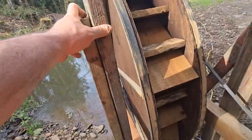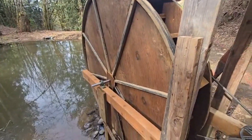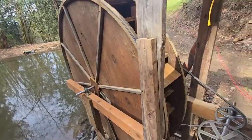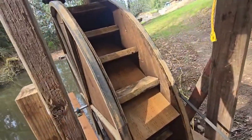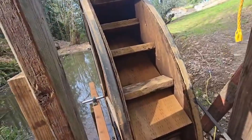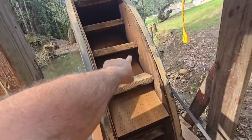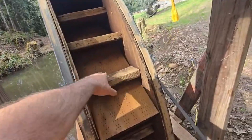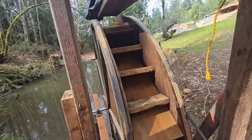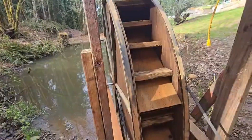These are two seven-foot cable reels from the phone company — we've got videos on that. Anyway, you want as many buckets as you can get and as big a water wheel as you can get. You also want to silicone each bucket better than I did, so the water stays in there longer. The longer the water is in the bucket before it dumps out, the better rotation and more torque you're going to get out of the wheel.